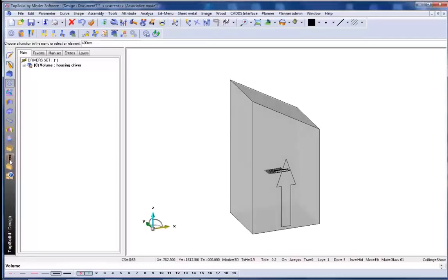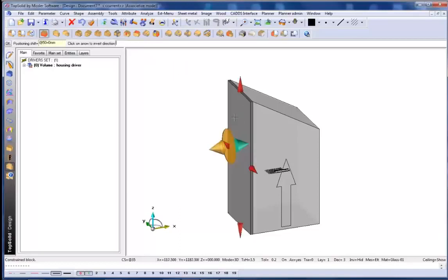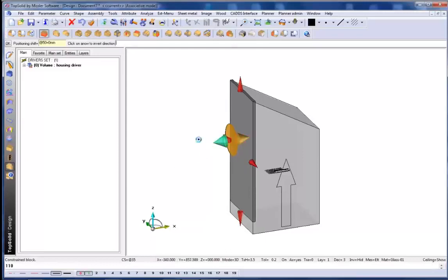So let's now start filling that volume in with actual panels. So the thickness of my panels might be 22, could be 25, it could be 18, it could be 16. So let's raise this maybe 120 mil off the ground because we might want some adjustable feet. Let's create the other side. Now you can copy that as well if you needed to.